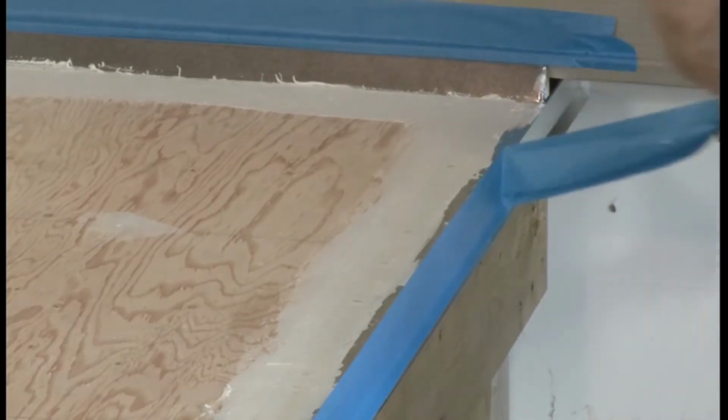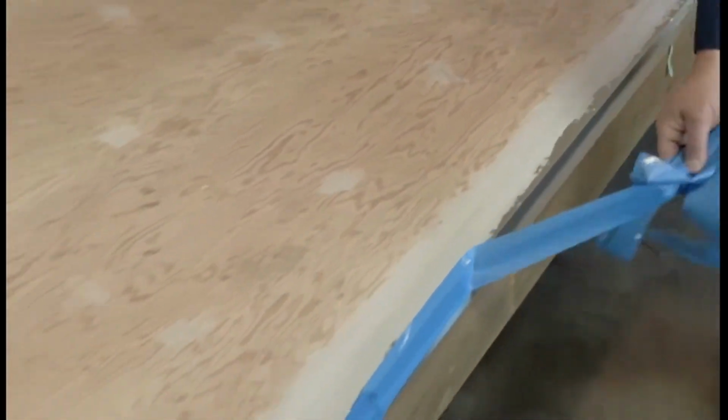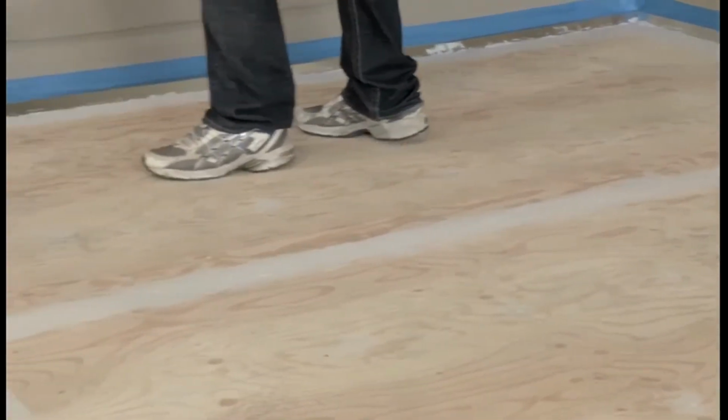If you have placed masking tape on the perimeter flashing during filling, it can now be removed. The masking tape on the siding should stay in place to protect it from application of Step 1 to Step 3. Be sure to sweep the deck prior to applying the primer.